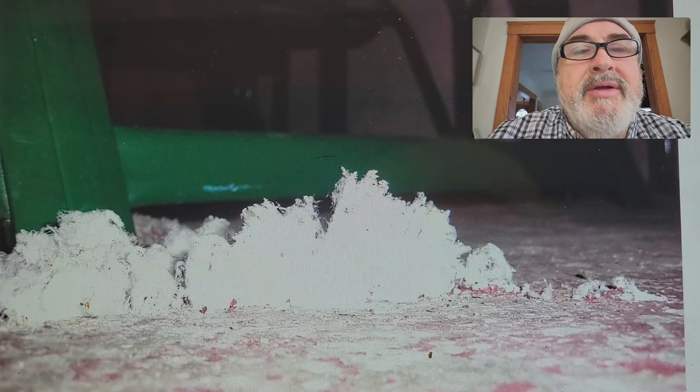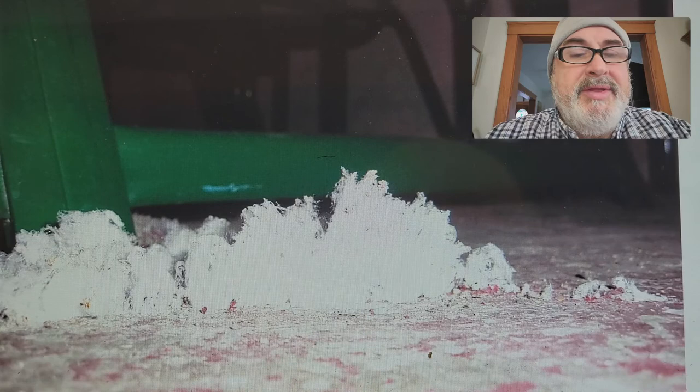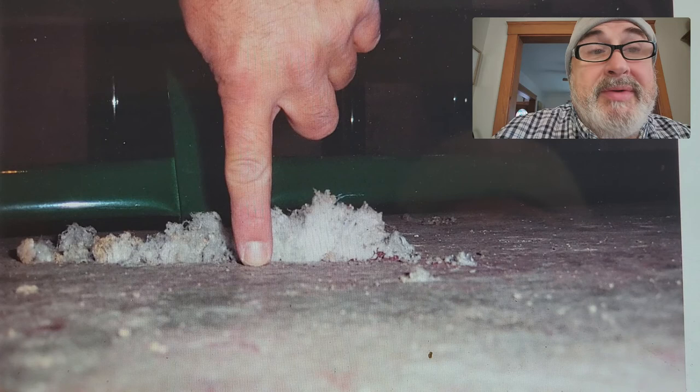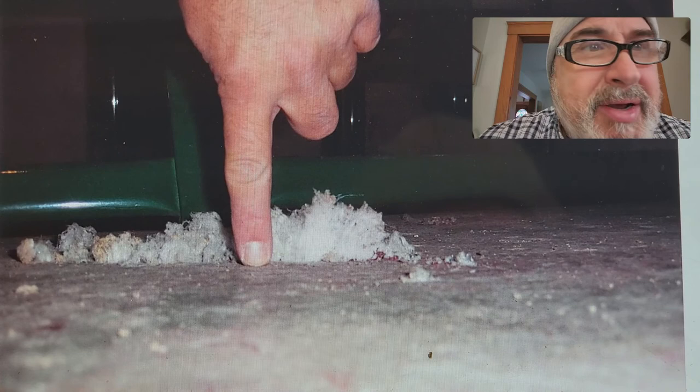Sometimes you don't test it because it costs money. You just ask: why is it growing, why is it leaching, what's going on here? Obviously you've got damp rise on floors — this is on a foundation. If you have damp rise, you're going to have moisture and mold will generally grow. That's a better view — you can see it's kind of growing up. So it's some kind of bio growth because of high humidity. You could send it to a lab, speciate it, and find out what it is.